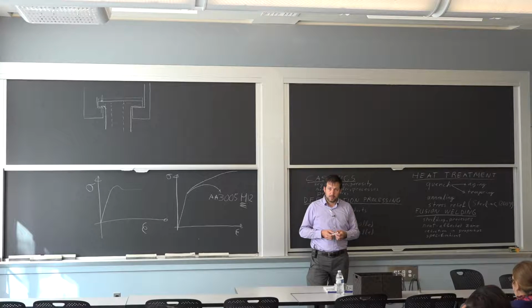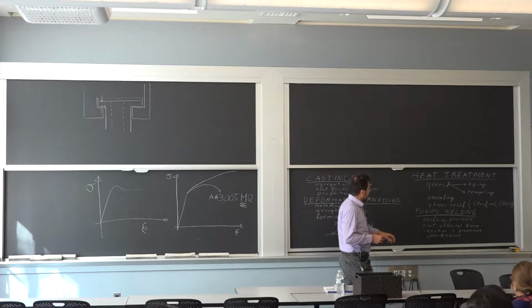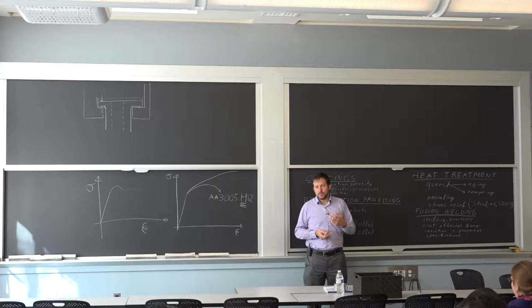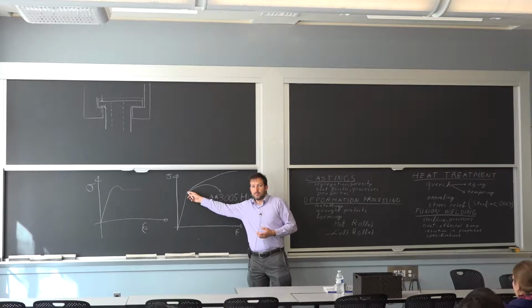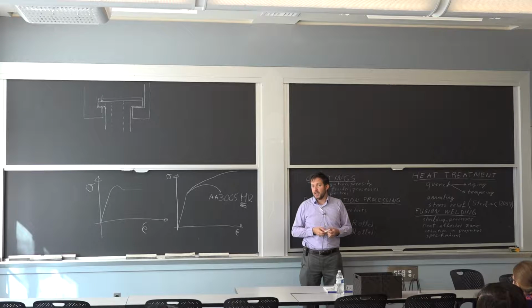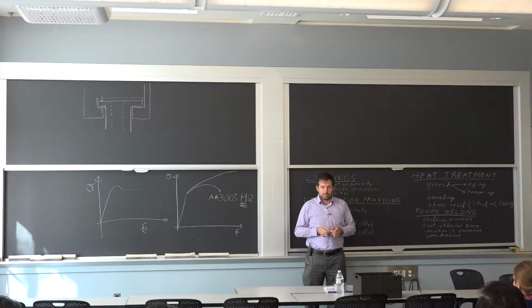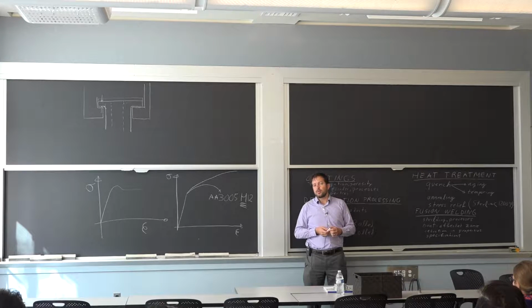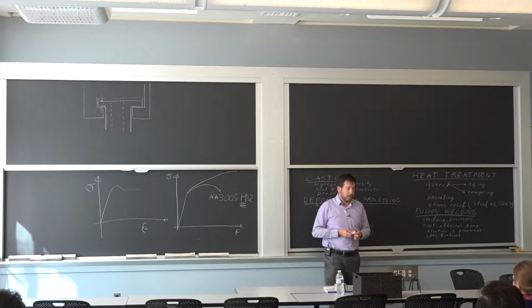So for stress relief, that's like a kinetic argument? Like higher diffusion? Okay, because the stress relief is at a lower temperature, what happens is you're reducing a lot the yield stress of the material, so it will deform by itself. That is probably the best way I can explain it. You have so much thermal energy that you can have the dislocations remove the stresses by movement. It's really soft at that temperature, but it doesn't require any change in the grain structure or the microstructure. That's a very good question.